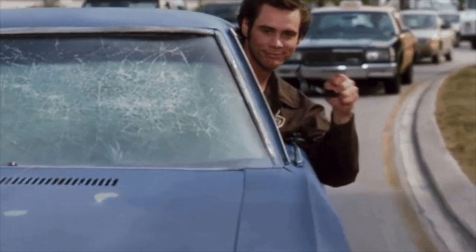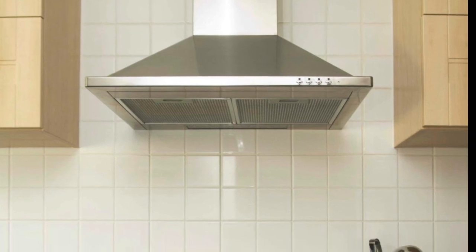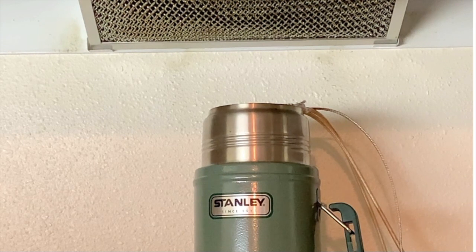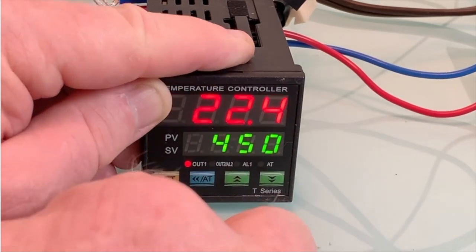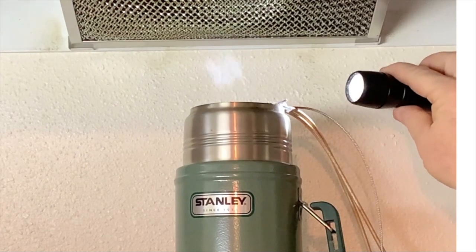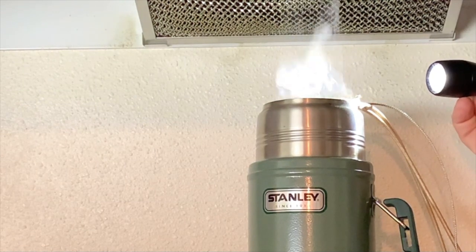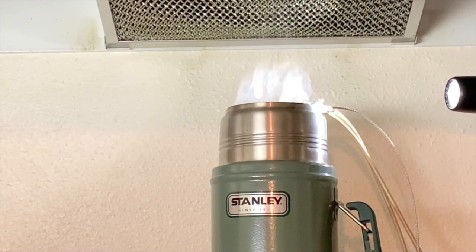Make sure to take the proper precautions. It's best to do this outside, but if you live in tight quarters with your neighbors, you should be able to vent the smoke safely using your kitchen fan. For experiments like this one, I usually block up my micro-kiln so it comes just a centimeter or two below the vent. I left a larger gap here than you should because I wanted to make sure you'd be able to see the smoke clearly on this video. With that said, turn your kitchen fan on high and set the set point on the kiln to 450 degrees centigrade. Adjust the power to medium just to keep the reaction moving along at a cautious rate. Smoke should start to appear at around 300 degrees C and should start billowing out as the temperature continues to climb.